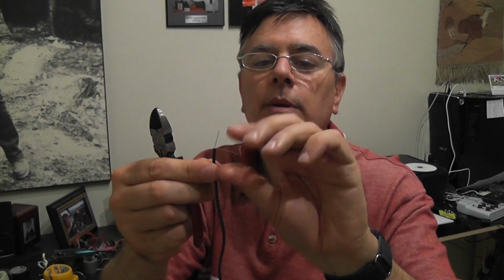So what I'm going to do is I'm always going to use my center wire as the positive side. That way I can keep things consistent, and also because that's where the current supposedly would originate from, I am going to make sure that it's inside the double insulation. So I'm just going to trim that down a little bit because I don't need that much sticking out. There we go. And I will do the same with the other piece that's sticking out here.